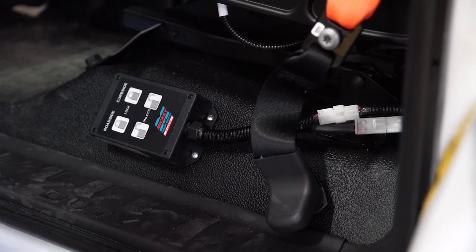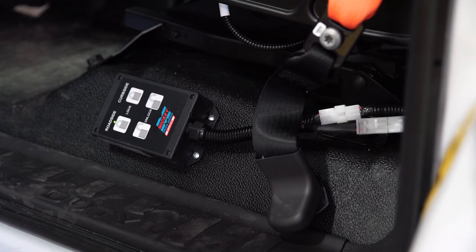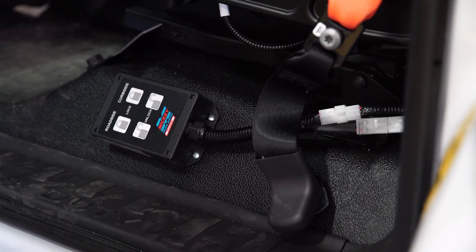To correct a bad actuator, go to the locking mechanism inside the bulkhead and trace the wires up to the plug. If it is plugged in, you likely have a faulty actuator that can be replaced. If when you try to lock the doors you receive a fault error, both lights will flash and the locks will return to the unlocked position.